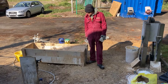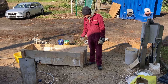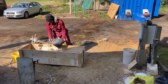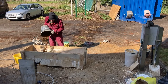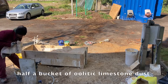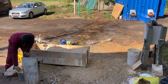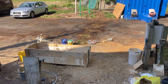We're going to mix the dry aggregates in the coffin, as we call it, prior to mixing with the lime. Two buckets of Bilney sand — it's a sharp sand. Half a bucket of oolitic limestone dust, which helps make the mortar workable and improves its performance, and helps with moisture.